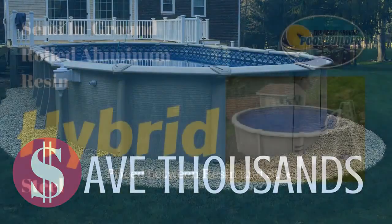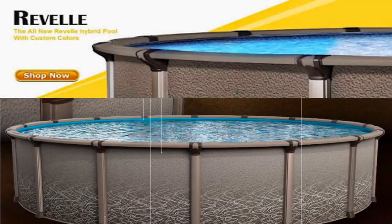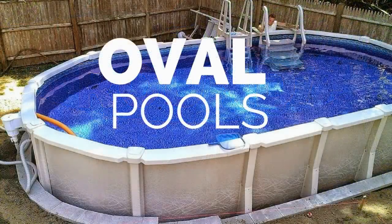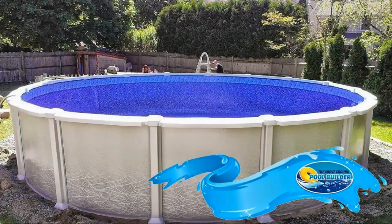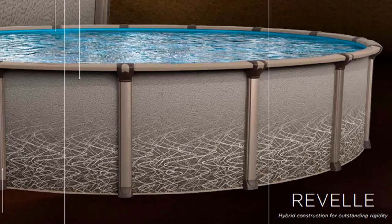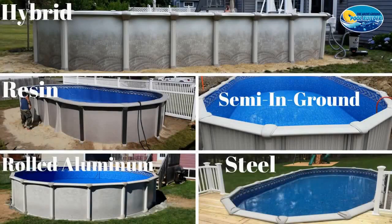Last is the hybrid above-ground pool. This pool is a combination of resin and steel. It has most of the characteristics of a resin pool and the strength of a steel pool. This pool offers true radius top ledges and contoured resin components that allow for a more modern appearance. A hybrid pool is priced between steel and resin and has some good advantages. A true hybrid pool has steel uprights attaching to coping made of steel, and the rest of the components are made of resin. These steel coping rails can be switched on some pool models, Mission, Supernova, and Revel, so it can support saltwater applications.